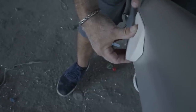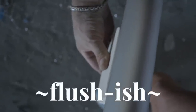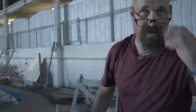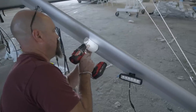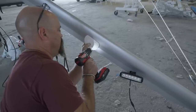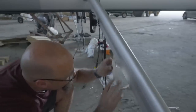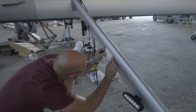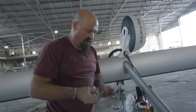It might be easier to see on this side — the profile's the same. It looks like it stops and there's a shelf, but if you look down the face, it's flush. Now that I've gotten down to the final shape on the puck, I'm drilling through the pre-drilled holes matched up from the camera base, using the tip of the drill bit to mark and ever so slightly score the surface of the spreader. After that I'll go back, drill the holes, tap it, and put the screws in. It's perfect.